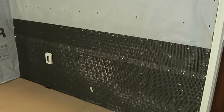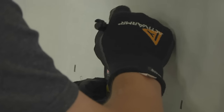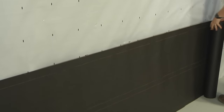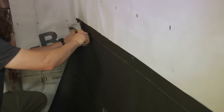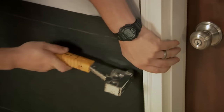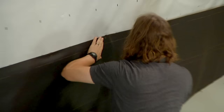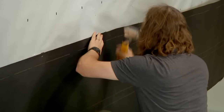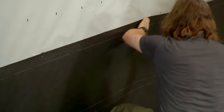The first thing we'll do is prepare the surface. Mark the stud locations on the wall sheathing to make it easier to install the metal lath. Next, secure a water-resistant barrier using two layers of house wrap or grade D felt. Apply the layers shingle style with horizontal overlaps of at least 2 inches and 6-inch overlaps on vertical seams.